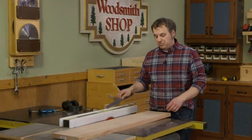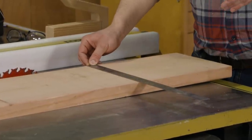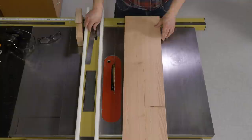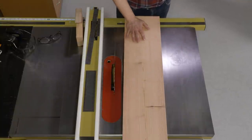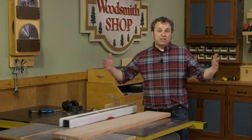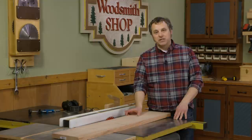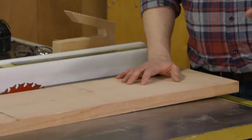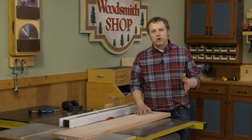After the jointer and planer, I have about nine inches to work with. The original plans call for one strip at three and a half inches wide and two more at three inches wide, but that's for the original bench which was almost six feet long — mine's going to be much shorter. So I'm going to shrink the parts: instead of three and a half, I'll do three inches, and then two more at two and a half inches. I'll adapt the part sizes as I go along, which is something I have to do on just about any project anyway.